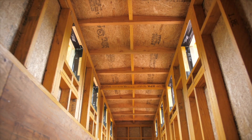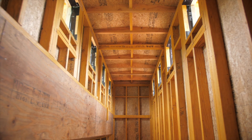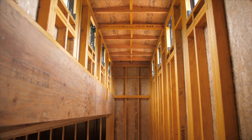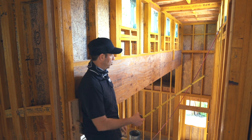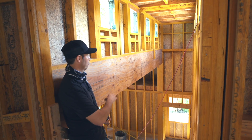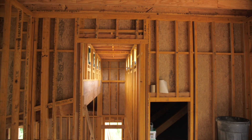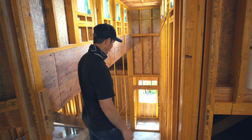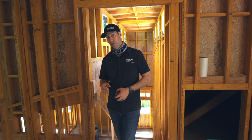This is a good example of why I'd want to use engineered studs. These windows face north and east, so as the sun comes up I'll have it raking down this wall. If I had any bow or imperfections, you'd really see it as that light hits and rakes across the surface. Having these LVL studs and that perfectly straight wall — that's beautiful.